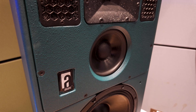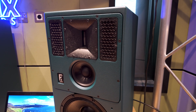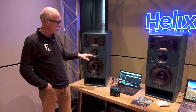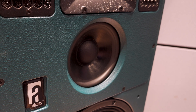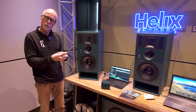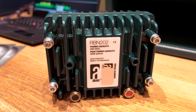From one kilohertz down to about 250 hertz is taken care of by the five-inch driver. This is unique in that it's a two-coil motor structure — one active coil connected to the cone, and a secondary passive coil in the gap that takes away the inductance generated by the movement of the speaker. Any speaker by moving creates inductance, and that inductance comes back in the form of distortion and coloring. With that motor structure, we take away the distortion and the coloring, giving a super natural response — an ideal combination with the RBN 202 driver.